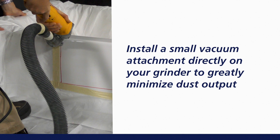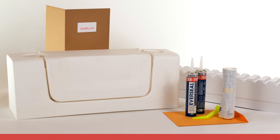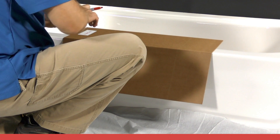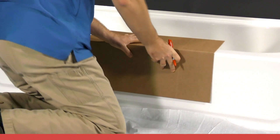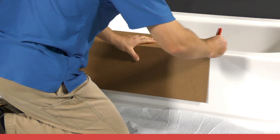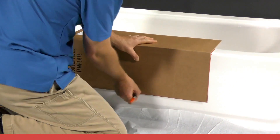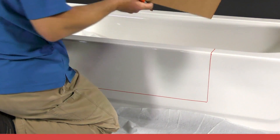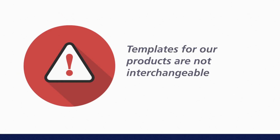CleanCut is pleased to offer these attachments for purchase. Once the tub area is prepared for installation, use the template included in the installation kit. Place the template flush against the tub in the same area you used to determine product sizing and begin tracing. Use a red Sharpie marker to make the traced lines easily visible. Flip the template over and trace the outside of the tub. Note that the templates for the Step, Ultra Low, Door, and Convertible are all different and not interchangeable.